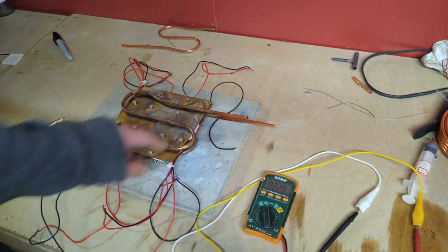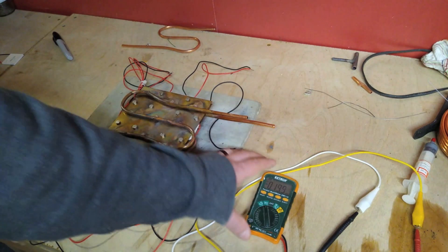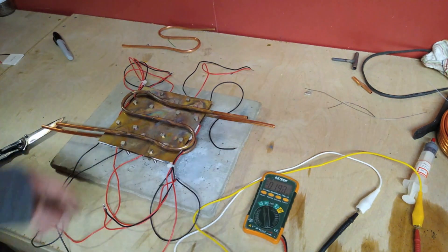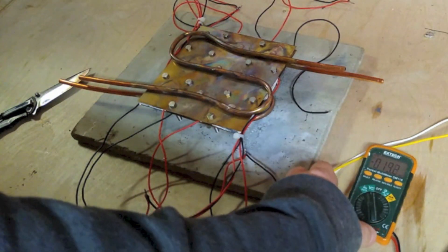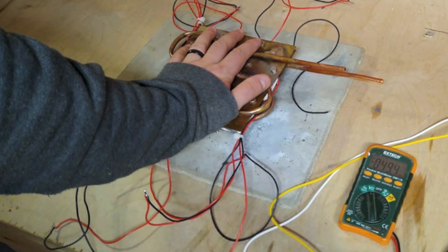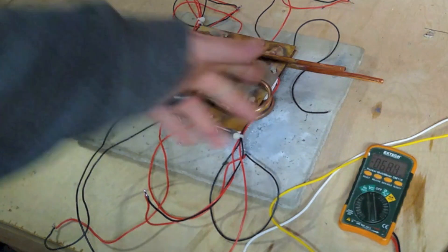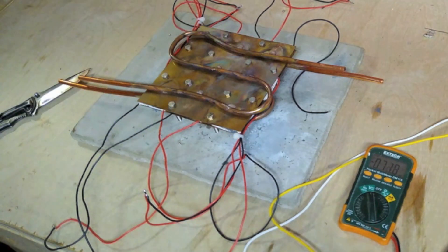So now I just got these ones hooked up right here. You can see I've got my meter plugged up, using alligator clips to hook these up. It's 20 millivolts right now. Let's put my hand on here to warm it up a bit. Now it's 30, 40, 50 millivolts. So we know that there is continuity at least through these four Peltier modules.